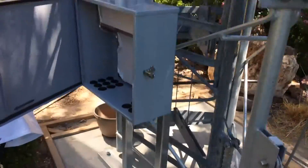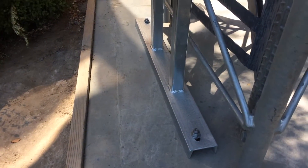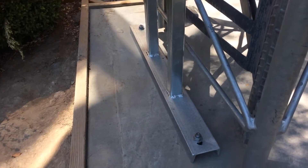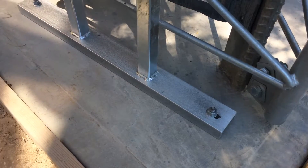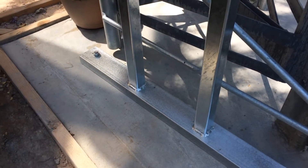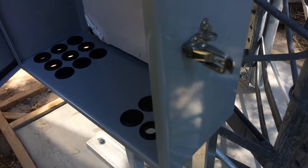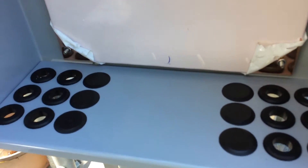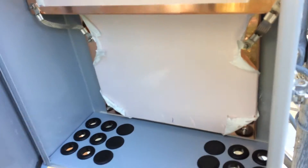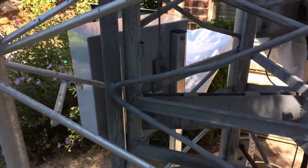This is one of the larger junction boxes. The base is really nice — at first I thought I was going to mount it to the tower, but I just couldn't come up with a good way to do it. Chris sells this galvanized base for the junction boxes. I drilled half-inch holes about five inches deep — with the right hammer drill it's like going through wood. These are five-and-a-half-inch bolts holding it down and it is rock solid. You can see the copper ground plane plates and the grommets in there.